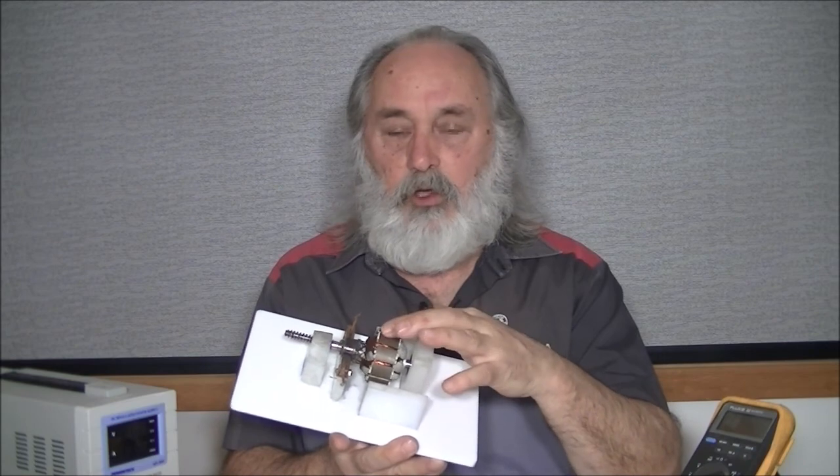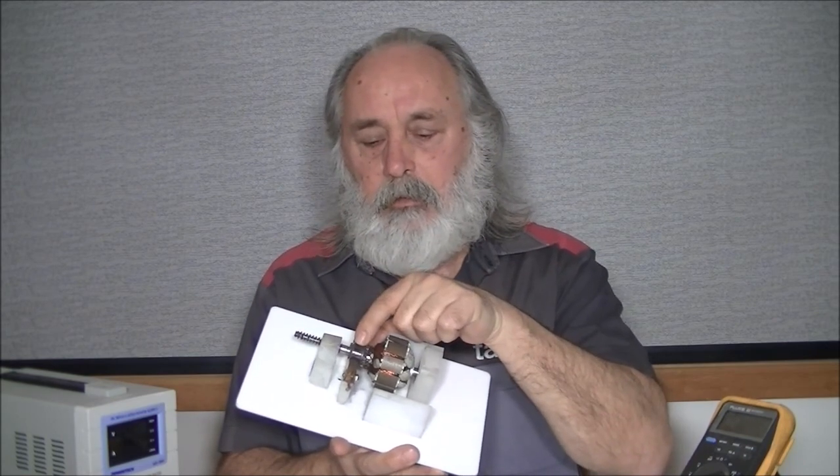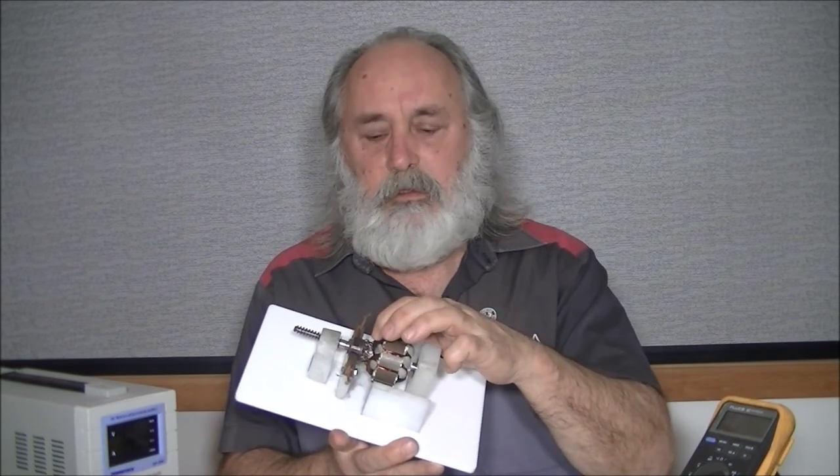So there you have it — that's the story of DC motors and how they work. We started off with permanent magnets, looked at electromagnets, electromagnetic fields, and the interaction between those two fields. We looked at how you can strengthen the magnetic field using a coil and putting a soft iron core in it to make a very strong electromagnet. Here's our main field, which is used in the DC motor for the armature magnetic field to react against to give us motion. The rest of the motor consists of an armature with a core, windings, a commutator, brushes, and a shaft. The commutator carries the current to the windings, and the brushes connect to the commutator to carry the current there. Hope you understand how a DC motor works now — thanks for watching.